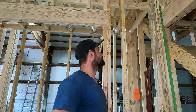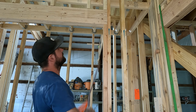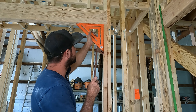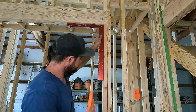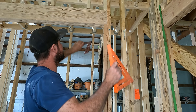I like to have a framing square so I can just throw it up in a door opening and check if things are level. If I don't have a framing square I'll use a 12-inch square. What I'm looking for is that it's perfect — if it's not, something's a little goofy and I'll grab a level. When it's perfect it even rings a little bit — that's how you know it's good. No gap, no gap, check it the other way. I hope you enjoyed this video.